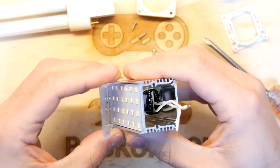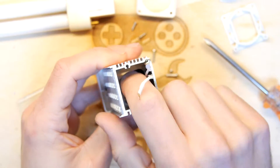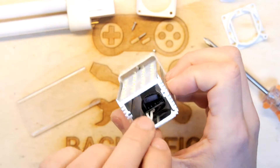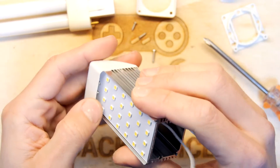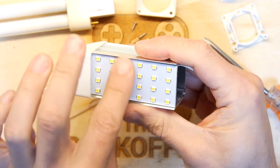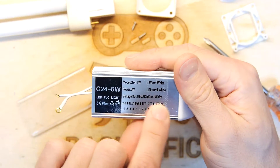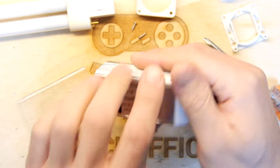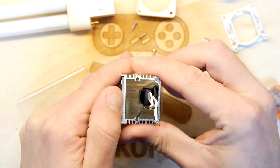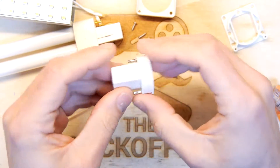It's a nice aluminium extrusion basically — the LEDs are on a flat plate here. Inside there's a big control pack which is probably full of the usual LED gubbins, but more importantly it's the actual power supply for these LEDs because they're going to be driven off mains and the LEDs of course aren't mains. 5 watts, made up by 134 — 24 LEDs. It says G24 on the back, that's the fitting. Cool white. It's just a simple PCB bonded to the aluminium for heat dissipation. I'm going to find a small drill bit and I'll see you back here in a moment.